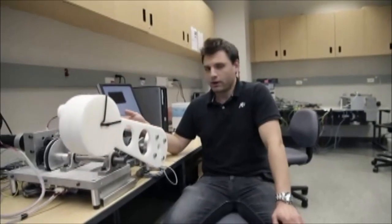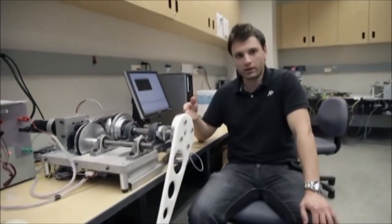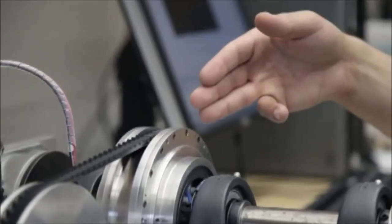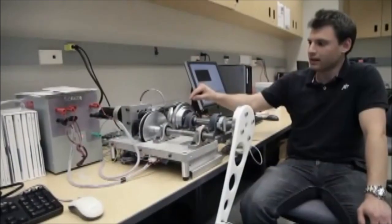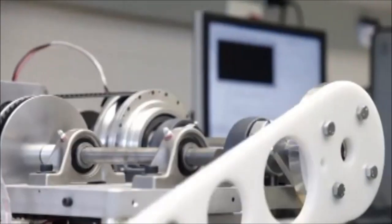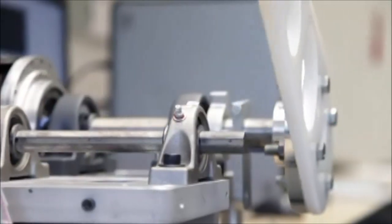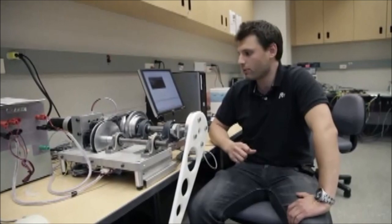This is an example of our actuation approach, which uses a single magneto-rheological clutch to drive a robotic arm. The transmission torque is controlled by varying the magnetic field inside the clutch. Tiny sensors embedded inside the design of the clutch allow us to measure the intensity of the magnetic field. By using feedback from these sensors, we're able to achieve closed-loop torque control without the use of costly torque sensors. Torque control is essential in human-safe applications as well as numerous other robotic and industrial applications.